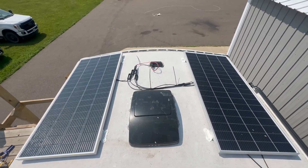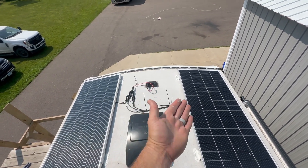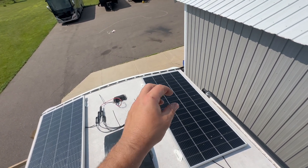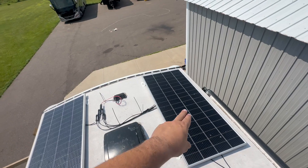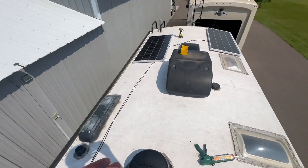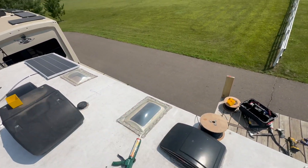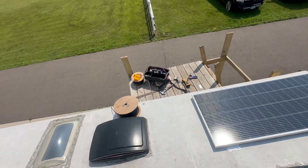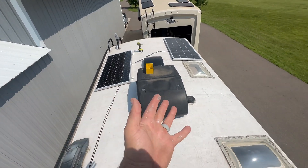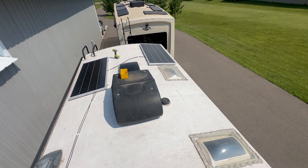This is a curved roof, so if I put both of these in series, now I've got different conditions — the sun hits differently, so this one's producing more power than that one. What's going to end up happening is the charger is going to optimize for this panel, not that panel, so we're going to end up getting less overall. Likewise, I could pair that panel with another, but my concern is they could be far apart — one under shade, one in full sun — and we'd get less than we otherwise would. So the only thing I could think of was to run them all in parallel.